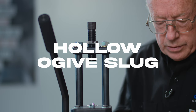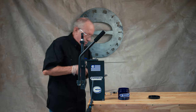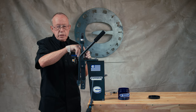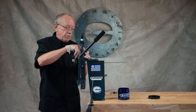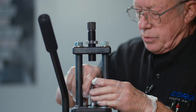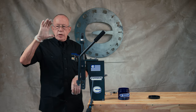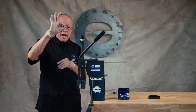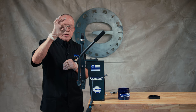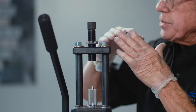The first part of producing a hollow ogive airgun slug is to preform a hollow cavity in the front end of the slug. The second part of the process is to go back into the original point forming die and bring that cavity just together to where it touches the pin, but no pressure is put on it to compress the slug at all.